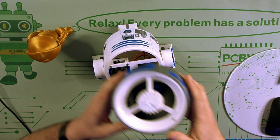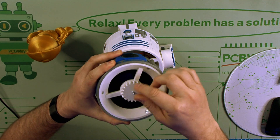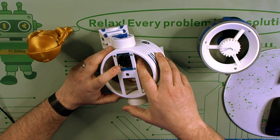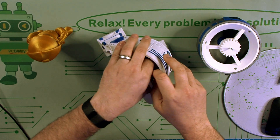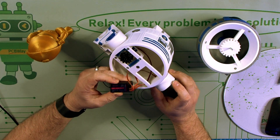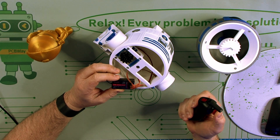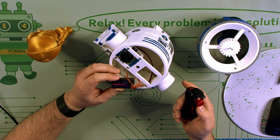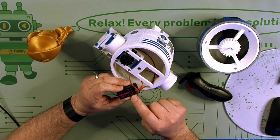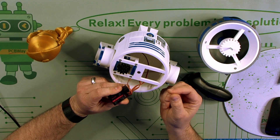Let's see what's under the dome — this is where all the magic happens. You have a two-part dome: the main dome and the internal ring. There is a gear system along with a three-millimeter screw that you screw onto the internals. That goes into a very small set of bearings inside this print. The gear system connects up to a 360 servo, which links into an RC receiver. This one can take around 14 volts, but we're running it at 6 volts using AA batteries for ease. The RC controller combo was around 15 pounds or $20 — super cheap.